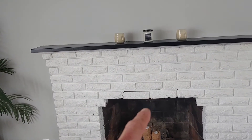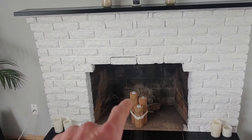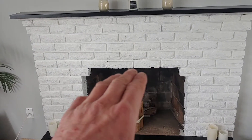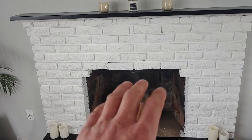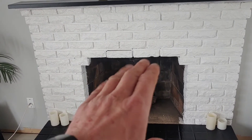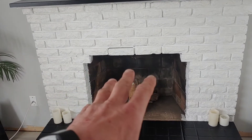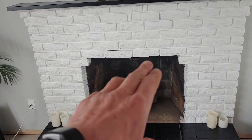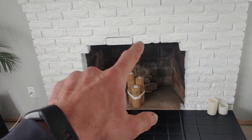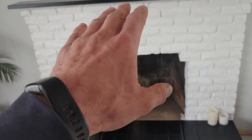We're also going to have to fix things up in here — you can see that brick is sagging where the old oil insert was. The previous owner compromised the lintel to fit the oil stove. We're going to have to fix this up. We're not going to make this wood burning anymore, so I think I'm probably just going to do this in lumber. I want to push this brick back in place and help support the rest of the face.